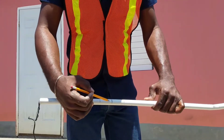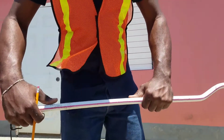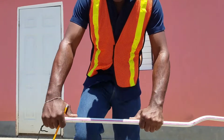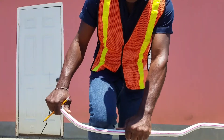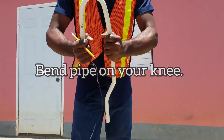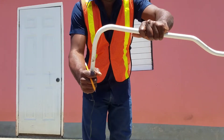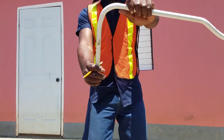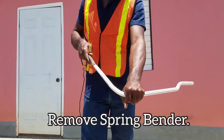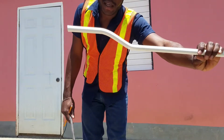We have our three marks for the 90 degree bend. What you want to do is start your bend at each of the end lines — start on this end line, then go to the other end line, and then go in the middle. You want to carry it a little further than your 90 degrees and then release it. We release it and — yep, we have our 90 degree bend. It looks good, so go ahead and remove the spring bender. Here we have our 90 degree bend and our offset.